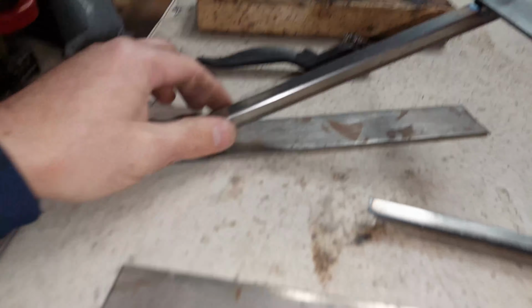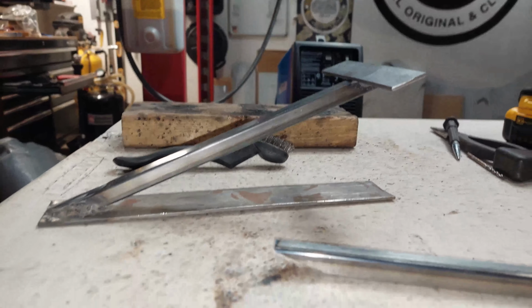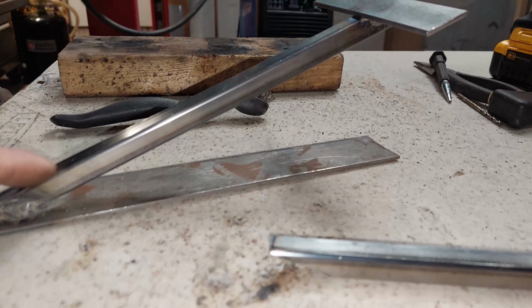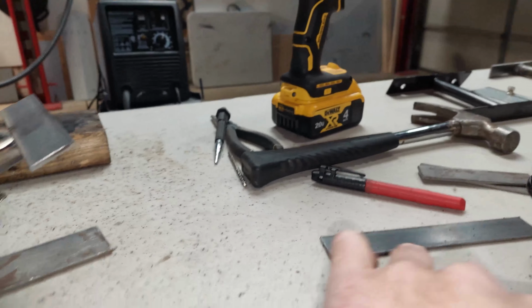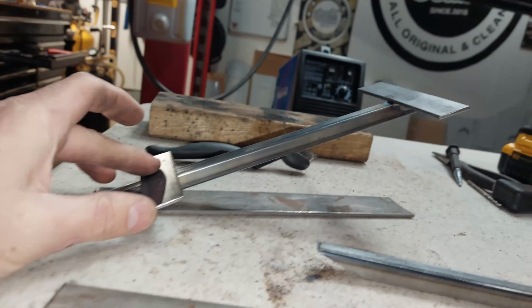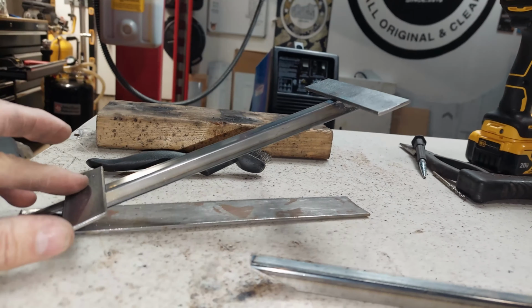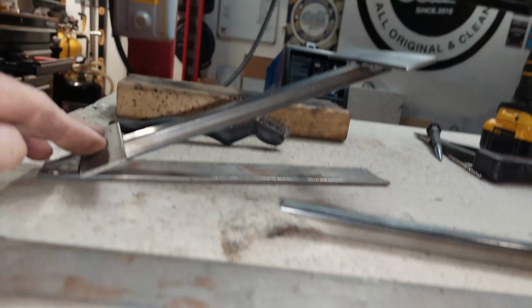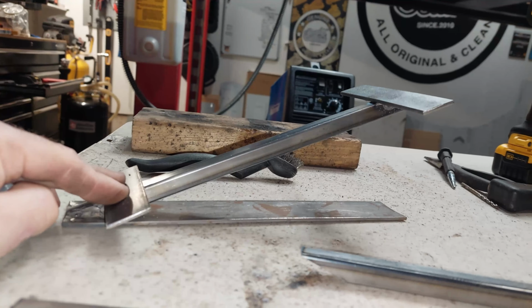So I went ahead and welded up 1 of the brackets. So I guess you guys kind of get the idea where the compressor is going to sit. This is the top plate. I'm going to weld up another top plate here. I just got to measure it out. So another one is going to go like that. And that'll kind of give sort of like a slanted compressor base. I just put a compressor up to it, so it's approximately up to here.